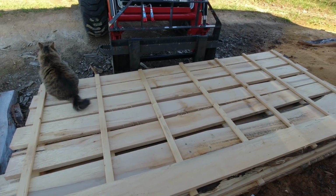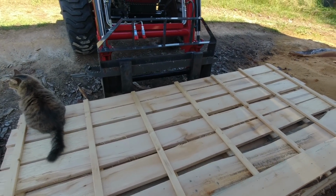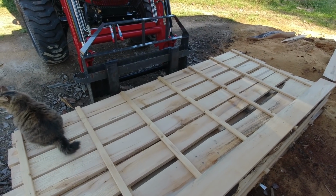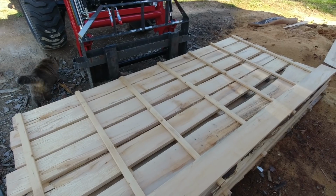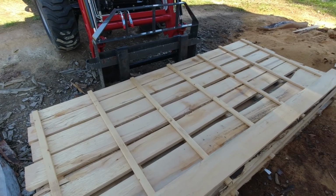And they are kiln dry. That's one thing that's very important. When you get stickers, you want to make sure they're dry. Don't use green stickers on wet wood, guys. It's not a good idea. You'll get sticker stain and all kinds of problems.